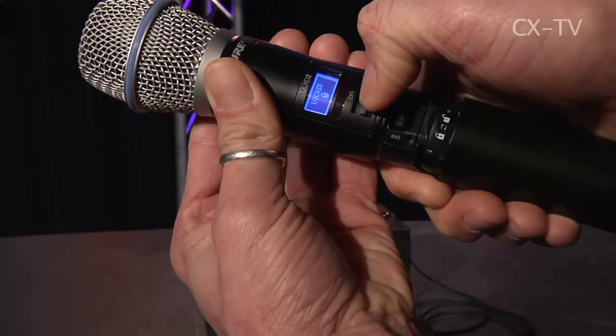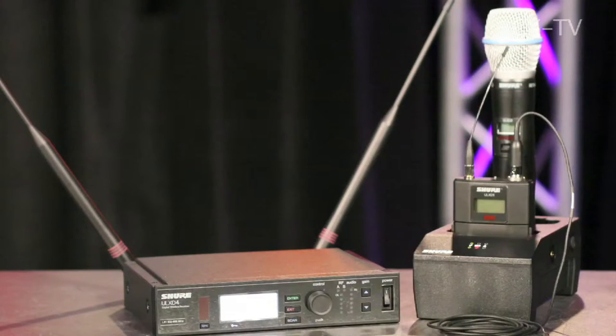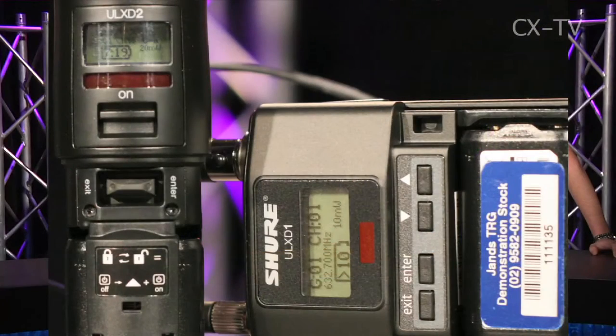The transmitters feel good — easy power switch, on/off slide, and you can lock that, which is important. In your application for live production, is this a system that will work for you? I believe it will. It's clean and simple, especially the one RU four-receiver concept — that's really clean. You can have a two RU rack with eight radio mics ready to go. Walk into a venue, scan for frequencies, sync your mics, you're ready to go. For prep time it's going to save money because it'll cut your prep time down on events — you're doing it in a quarter of the time. And you're not throwing away batteries every time you do a gig.